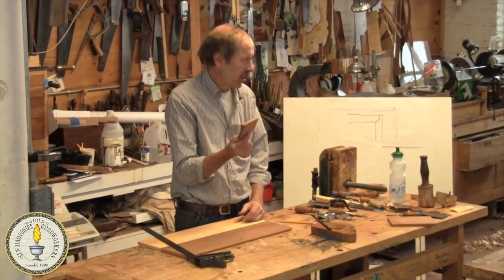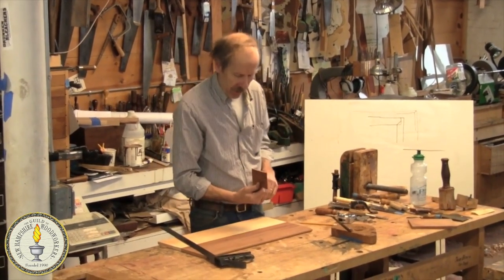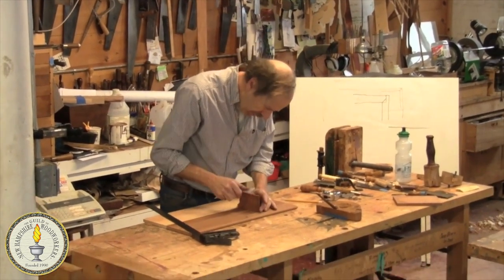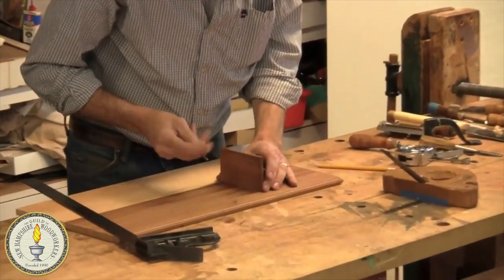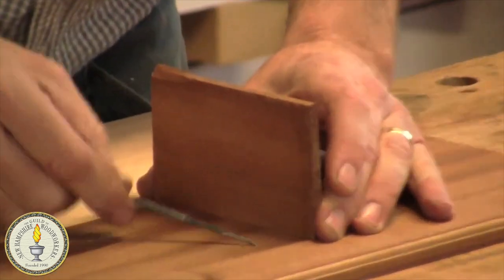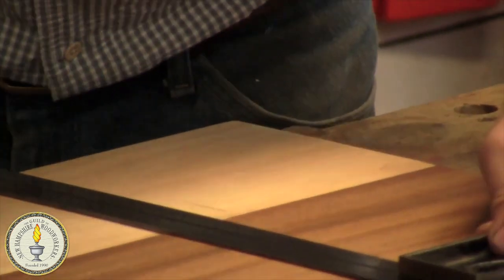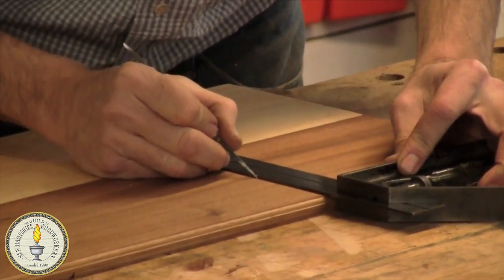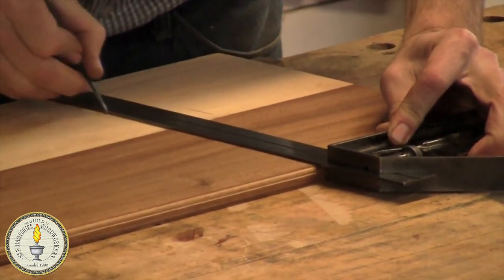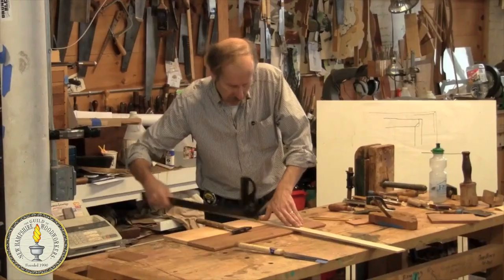So I've made a line here. Now I'm going to take a piece of wood that I'm actually going to use for the floor of that shelf — I'm assuming it's a quarter inch — and I'm going to lay it on my line and actually scribe the thickness of it on here. That way, that's sort of my theory of marking pieces from the actual pieces of wood.